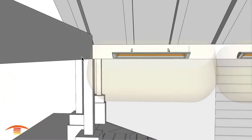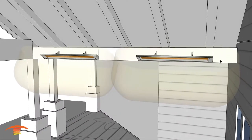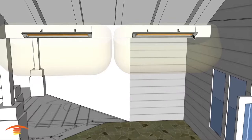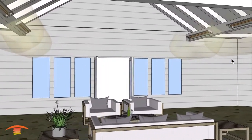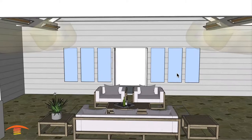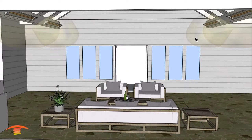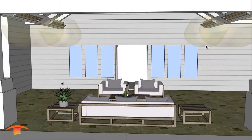You can see that I've just about matched up the ends here — 18 inches in, 18 inches in — and that gives you a little bit of overlapping in the middle, so that's the best we could do here. The same thing would be true over here. If you were going to use 6,000 watt units, that BTU demand would call for somewhere around 5.5 units total, and obviously we have four units here.